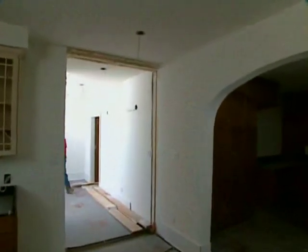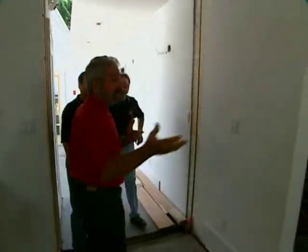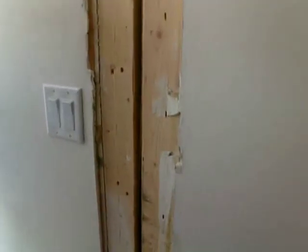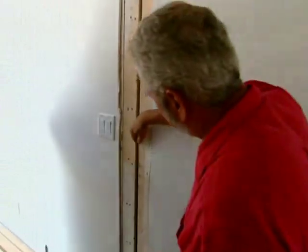Boy, this is impressive, though. What you don't really get when you see those boxes flying through the air is that on the inside, they're totally finished, except for a few little things. Now, what goes on here? Well, Bob, we call this the marriage wall. Right. And what they're going to do now, they'll insulate this, put some metal strapping on, and then put the sheetrock right over and finish it. And that little bit of a gap is not a problem.